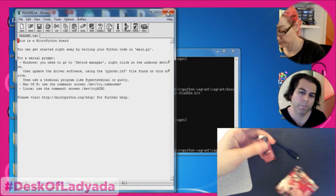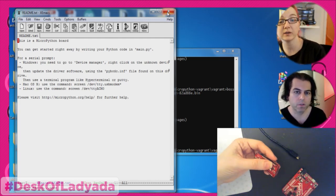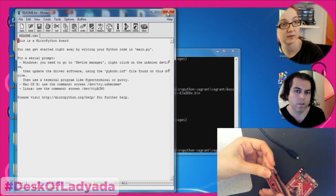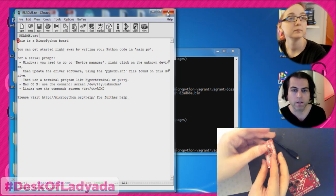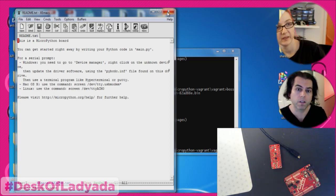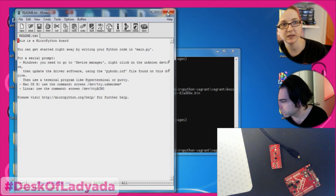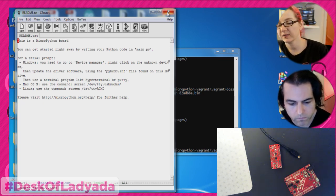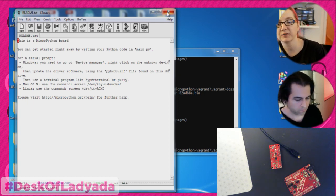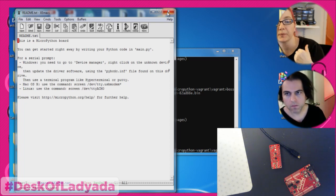And then I did a little sensor Feather — this is designed by Kate and I. To be clear, you can still decide to do an Arduino project; it is completely the same hardware as an Arduino, it just adds the extra two parts that make it work well with MicroPython. Someone might start out with MicroPython and then decide later there's a bunch of Arduino things that are more advanced. They just flash it as an Arduino and unlock all the Arduino things they can do. For the first 10 projects — blinking LED, NeoPixel, moving a servo, reading a potentiometer, playing a little audio — MicroPython does the job. Once you're getting into Wi-Fi, DMA, buffering, or complex calculations requiring speed, that's when you go to Arduino. Just like people write Python and then optimize by moving to C or C++.